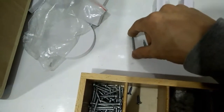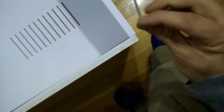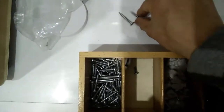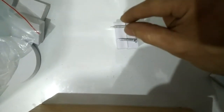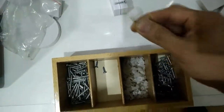Now, the long one is used where you butt up against, let's call it the end butt joint. That will give it maximum strength. It's going long and deep, and it holds in, biting quite nicely. But you only use the short one when you've got two blocks of wood going together like this, where you can't have it too long, or else you shoot through the second board, as demonstrated here. See that? That actually goes past the two boards sandwiched together. Remove that, and they'll be perfect. And coming through here in my other bits and pieces, this is your wire holder.